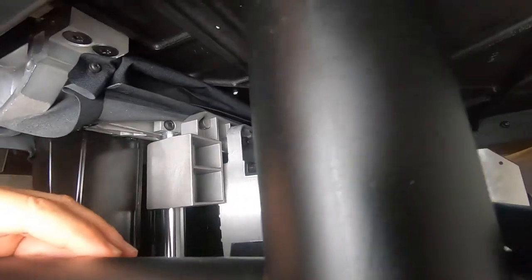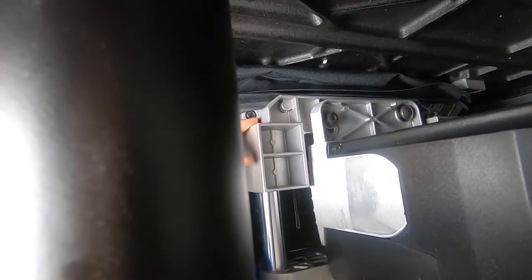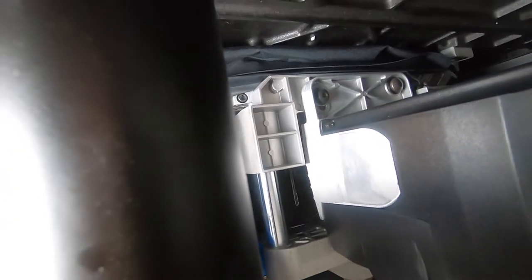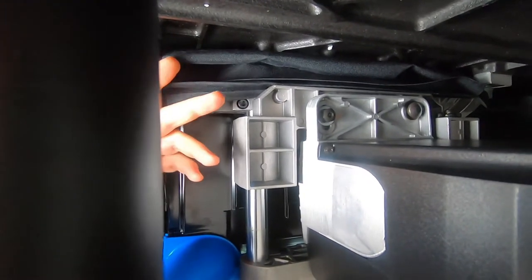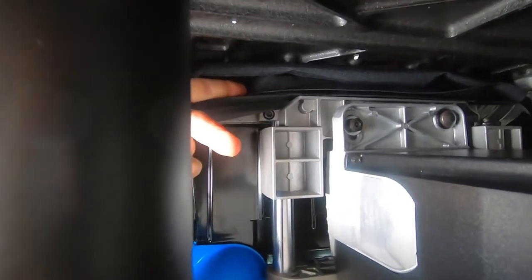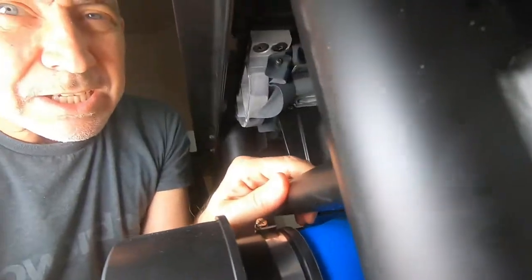And to undo it, to be able to move the blade, to be able to turn the blade a little bit, you need to back this off, this bolt. And then there's another bolt that's hidden by this fabric that forms the dust collection system, dust chute. So it's actually right here, the bolt. It's right here. And it's really, really inconvenient to be able to adjust that.